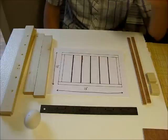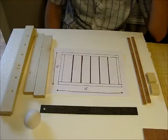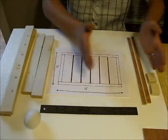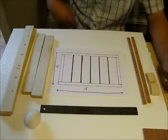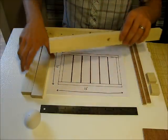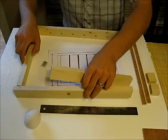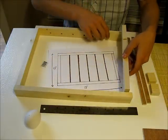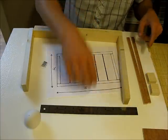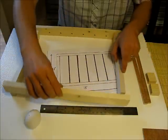So you want four inches of travel for your tray. Take the inside dimensions of your incubator — mine are just over 13 inches wide by about 19 inches in length. I'm going to make my tray four inches shorter than that so it has room to go back and forth. I cut the furring strips to 15 inches as shown in my drawing. When cutting the side pieces, account for the thickness of the boards going over the edge — I just put them next to each other and measure to 13 inches, mark it, and cut both at the same time.